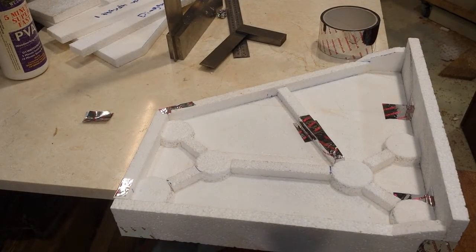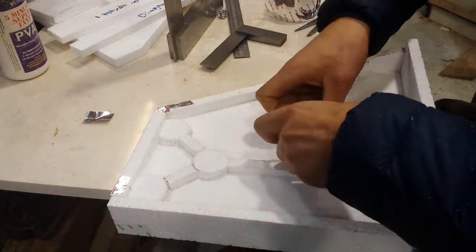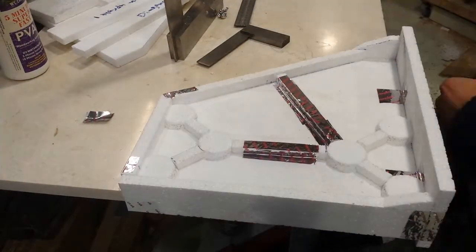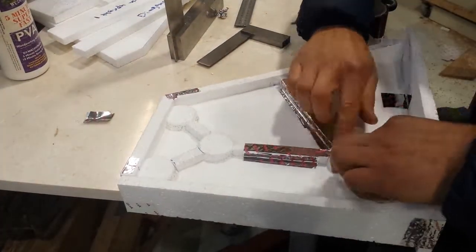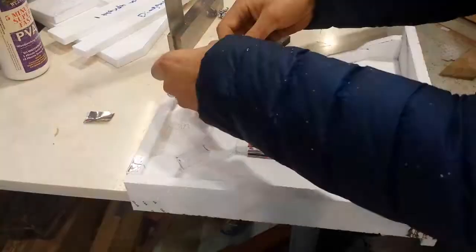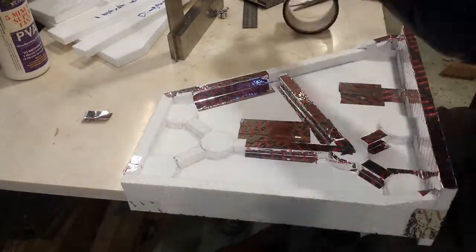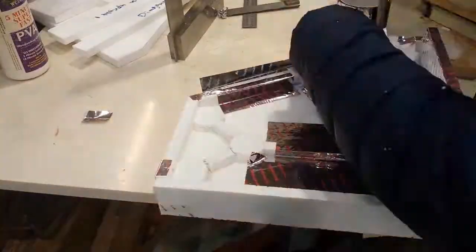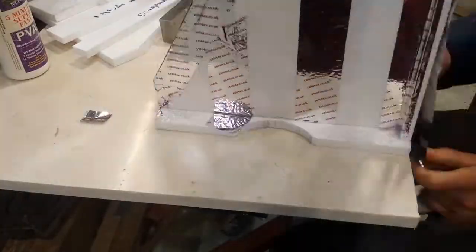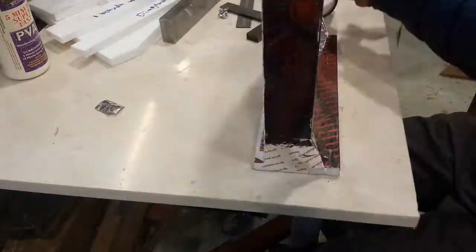This is how I do the joins by adding foil tape. This is stuff they use to seal the gaps between insulation boards — I just had a roll of it left over from some insulating work. It does a really good job of strengthening the pattern joints as well as leaving a really smooth surface on the outside, and bearing in mind the outside is what the sand is going to conform to, which essentially gives us the surface of our finished part.